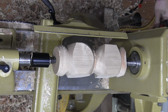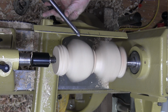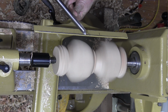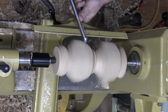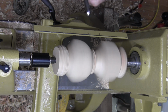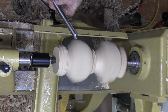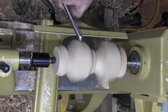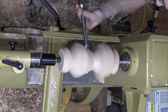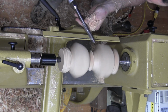So let's just rub the bevel on a couple of cuts and see what happens. Instead of going round with the bevel floating, you barely hear it on the surface. I'm just going to press in. The tool is getting into a rut, and it loses control. But if I float it, so it's barely on the surface, it's in super control. Going the other way.